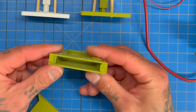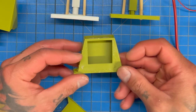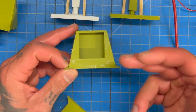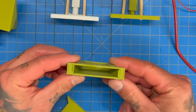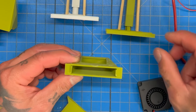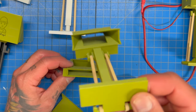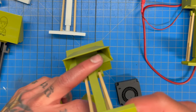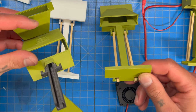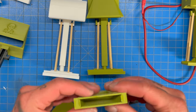This one alone showed the most promising of benefits, and I believe the reason for that was because there is more suction in this enclosure with this fan than it is with any of the other enclosures, meaning there was too little air resistance in here because there's such a big opening, and both of these, and including this one, super large cavity here. So air resistance was very minimal.